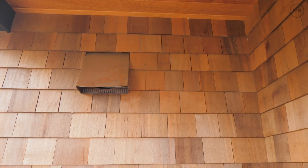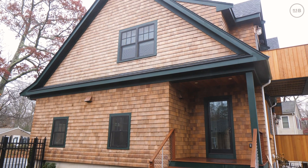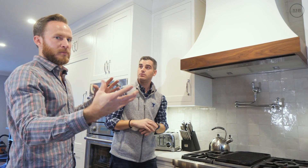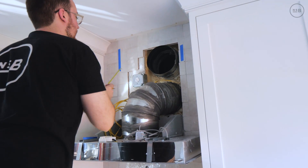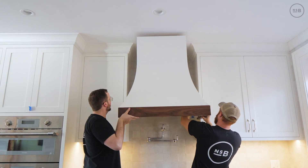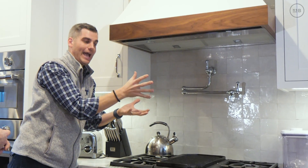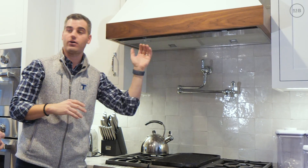The outer part around this is where the outside air is coming in, on a motorized damper approach. Outside air comes in through an intake 10 feet away from the exhaust, through a motorized damper, and basically falls through this face and down. There are actually two 10-inch round pieces of ductwork: one sealed to the exhaust fan, and the other dumps fresh air into the hood, which acts as a plenum to drop that fresh air out. To maintain efficiency, you've got to deliver the right amount of air at the right velocity — if it comes in too fast you get spillage; too slow and it does a really good job of capturing fumes from cooking and sending them up to the exhaust.